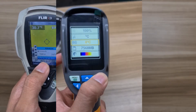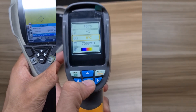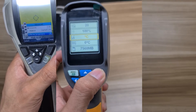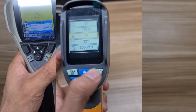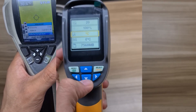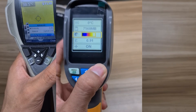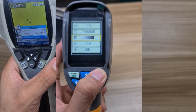The HT-02 has temperature unit selection, storage capacity display, and color palette selection between high contrast, black glow, white glow, iron, red, and rainbow. Emissivity setting can only be manually adjusted — there is no preset emissivity value. It has marking spot temperature and ambient temperature, or background temperature setting, which is a nice feature. There is automatic reading for the ambient temperature, so there is no need to adjust this part manually while doing testing.